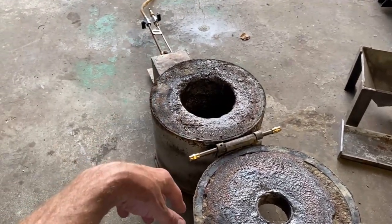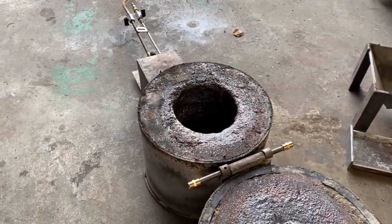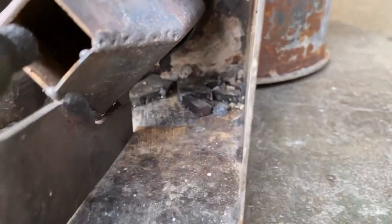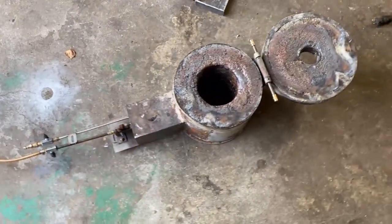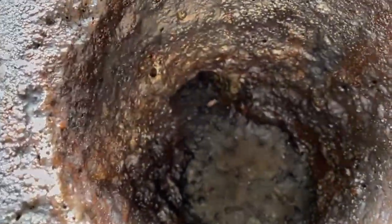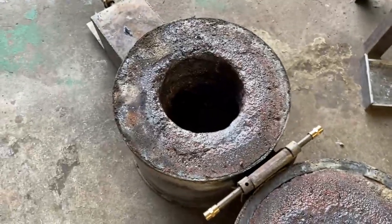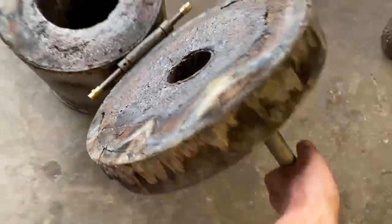The maximum temperature I've ever been able to get this thing up to is about 2,650 degrees on record. Based on some things I've melted I think I've hit 2,600 or 2,700, but I only have it on record at 2,650 Fahrenheit. Here is the old Godzilla burner, but there's a bunch of melted slag that's made its way through that I need to bust out. So we're going to take this thing apart, take the burner out, and chip away some of the melted material. This hole is just kind of melting over on itself — this is what it looks like after over 20 firings at 2,650 degrees. It's held up fantastic.